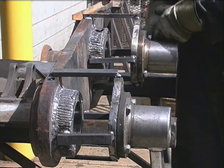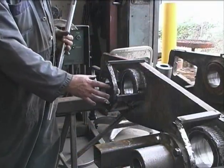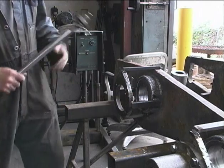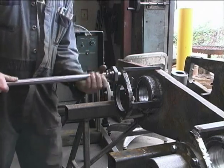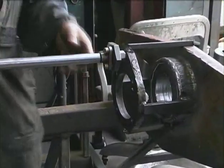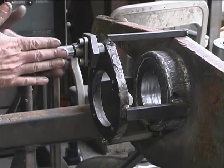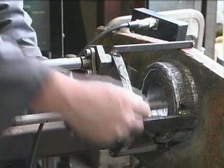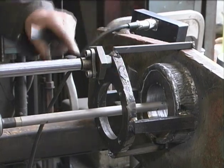Sometimes you can spend an hour getting the bars to line up — we were lucky. We've removed the double bearing and now we're preparing to install the bore welder. The bore has been cleaned out of all grease and rust. We take our rod and thread it into the top hole of the teardrop, which is why we mount the teardrop facing up — because when we install the welder, the welder will hang down off of this rod.